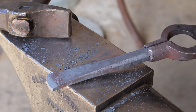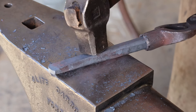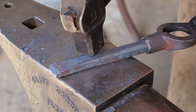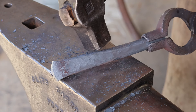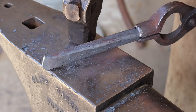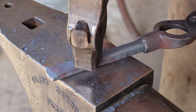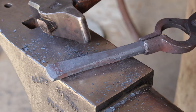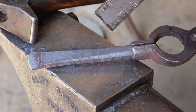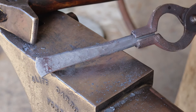Now is a good time to mention that if you are striking a wider piece of steel that is still pretty thick, every hammer blow is going to locally spread steel at the point of the hammer blow more than it's going to on the flip side or on the anvil face side, and more than it is on the opposite side of the same face you're striking. So you can see there's a little bit of a bump here and here that kind of goes out that direction. All in all, I've got a bit of an S-curve shape to it that I need to correct before I go too much farther.